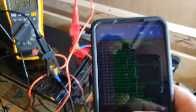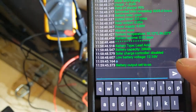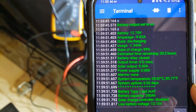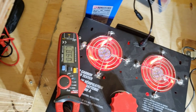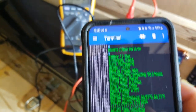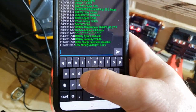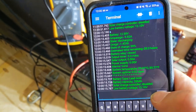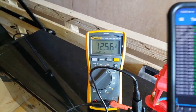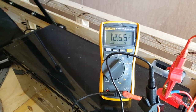We're not really drawing anything here, so I'm going to close the relay — you heard the click. If I go to status, it now says we are drawing 9.82 amps, and the clamp meter is saying 9.87 amps — that's right on. Refreshing the screen it's saying 12.59 volts, 12.55 volts — and that matches up. All systems go so far.